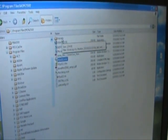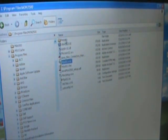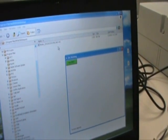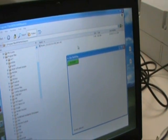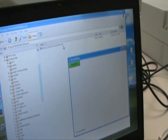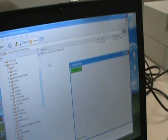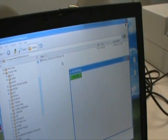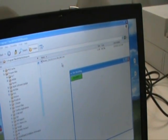Also, you want to open the reports directory because all alarms will be transferred from the area monitor via the network cable to this directory. One recommendation that we make in the reports directory, the area monitor will download an N42 extension file every minute. This is due to housekeeping within the unit and the system itself. We recommend that after 1 week that you archive these N42 files in another directory to make the reports directory easier to use if an alarm occurs.